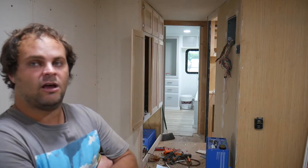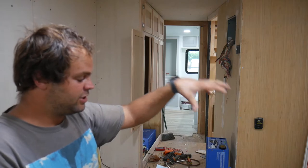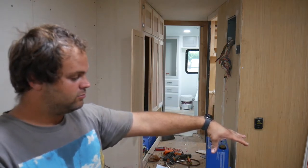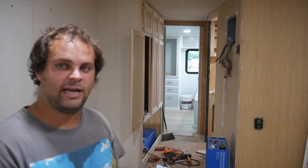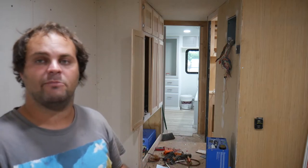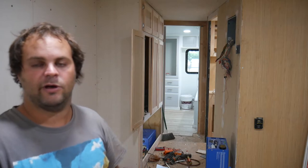Anyway, the locked rotor current on these air conditioners, let me back up. These two transfer switches that I've got seem to have a small amount of delay between when one contact opens and the other one closes. Enough for the air conditioners to stop, because when I've got the generator running, the generator will easily make a couple hundred amps.